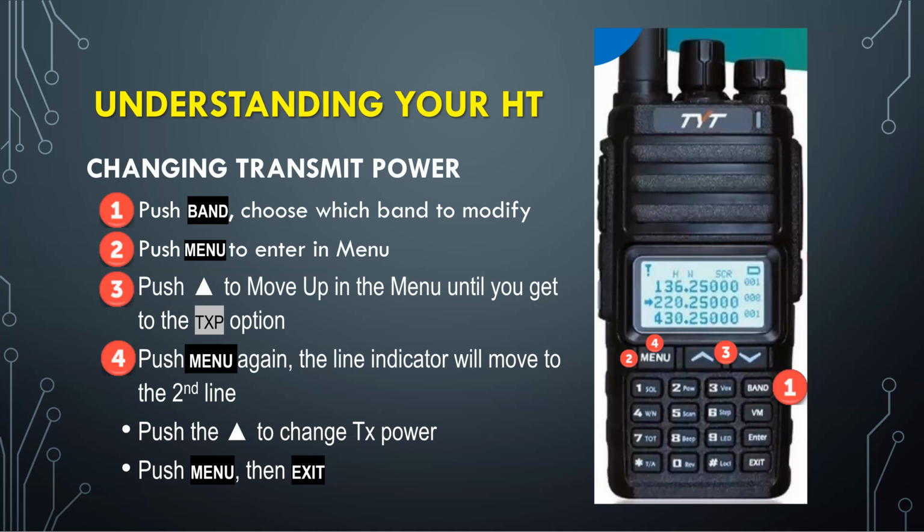Like a hearing aid that turns on only when the volume is at a certain level, when someone's talking to you. Yeah, that's what it does as well. And the risk is if you set that squelch too high, you're going to miss things, because it won't activate the receiver on a weak signal that's above the noise floor but below the squelch setting. So it's a balancing act.